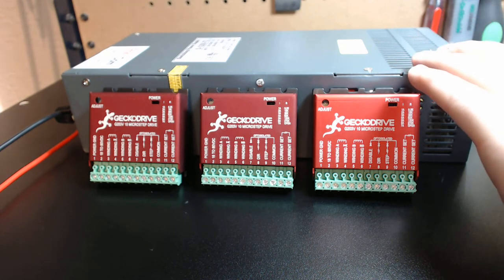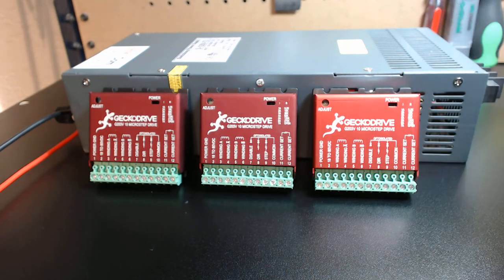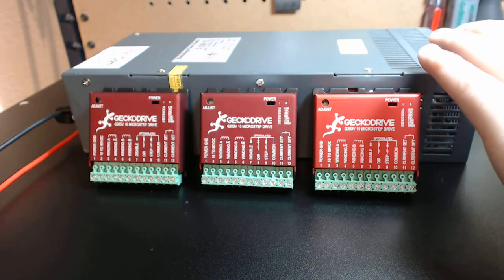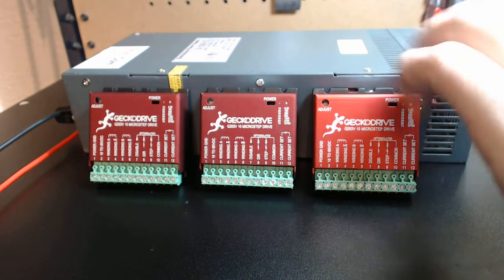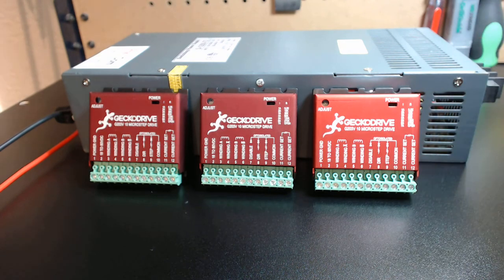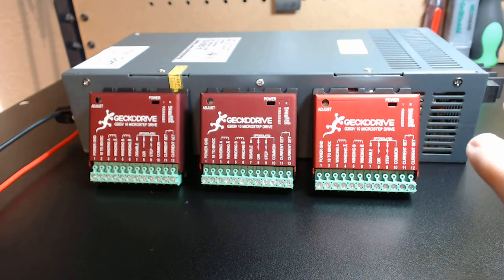Does it take more time to build? Yes, because these are individual components, whereas the G540 is an integrated system — the breakout board and all your drivers are encased inside the G540 enclosure. These are individual drives, which means you're going to need a breakout board. The initial cost for that is greater. You're also going to need the supporting components for the breakout board. That's why I put together my package — I get sick of seeing the a la carte technique used all over this industry, because we all know you're going to have to buy it anyway, and that's why I think the kits just make things easier.